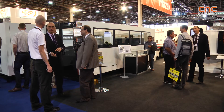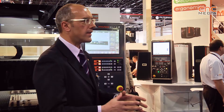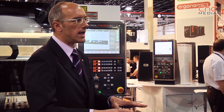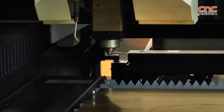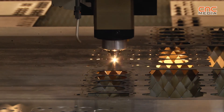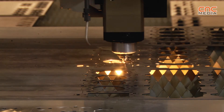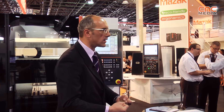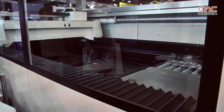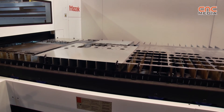The production in a big FMS system with a stocker works well, but more and more the volume of nesting and parts becomes less and less. So many times, the customer buys the machine as a standalone machine and cuts maybe one plate of 8 mm, then the next plate is 2 mm, then aluminium. The machine is suitable for this kind of job: you put the plate in, put the program in, the pallet changes, and automatically the torch and nozzle are changed — the machine is ready directly to cut.